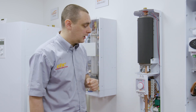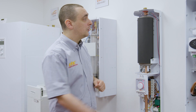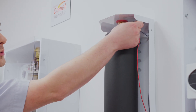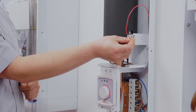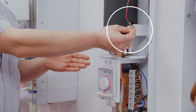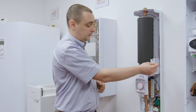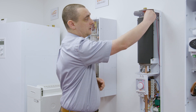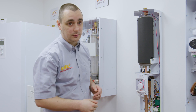We can test this theory and ensure that there is an air issue and not an electronic issue by disconnecting the sensor cable, routing it down onto a source of earth and holding it. If the fault then clears, this confirms that we do have air at the top of the boiler. Should the fault persist, this would then indicate that we have an issue with the circuit board at the bottom of the boiler.